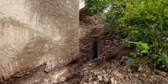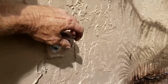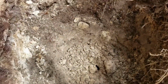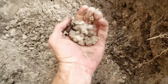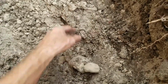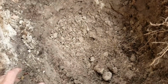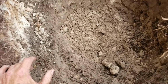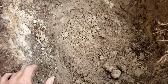This front wall is excavated, and what we're doing right now is we're digging the sump basin. The reason we're putting it here is because he happens to have an outlet right here, so it's easy to plug in. But what we're finding is, remember, this is the Florida Everglades, and it was just filled. They filled the swamp, and you can see the soil is getting more and more muddy as we get down deeper. They just brought in a bunch of backfill, a lot of rock, really trashy debris. Typical backfill that you put down when you're filling the swamp. But wow, really hard to dig through. So if you're going to do this yourself, be prepared, because as you start to dig down here in South Florida, especially out here on the west side of 95, you're going to find all of that.